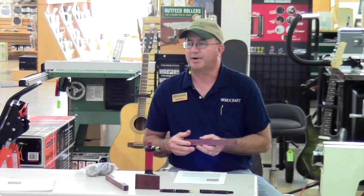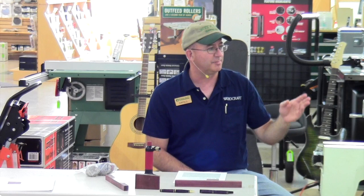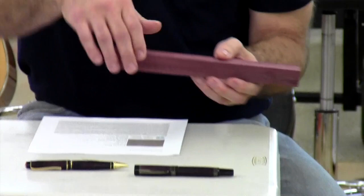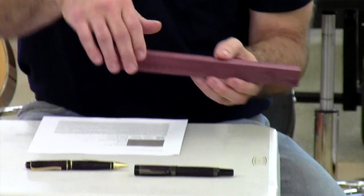If you want a brown pin you can get a brown color of wood, but if you want a purple pin, there is a way — and we're going to cover that — of turning that brown color back to purple. Here are a couple of examples. These are pins that I did about a year ago and they're a nice dark deep purple. If you leave Purple Heart unsealed, it will turn past that dark purple color to a brown color, as you can see on this piece here.